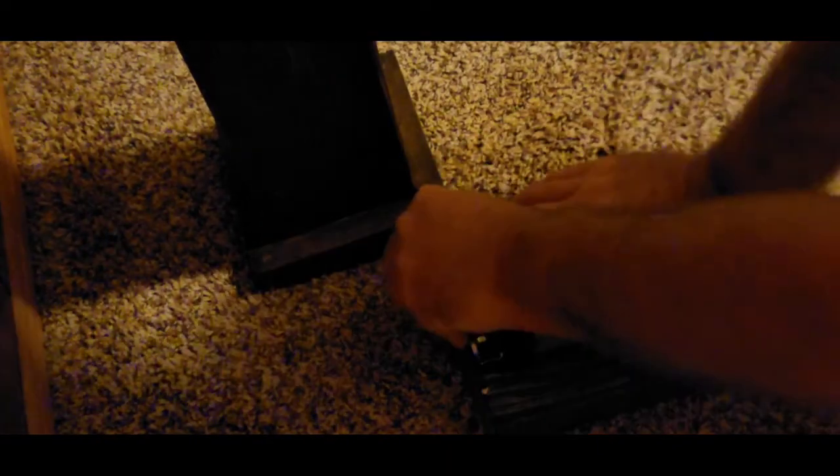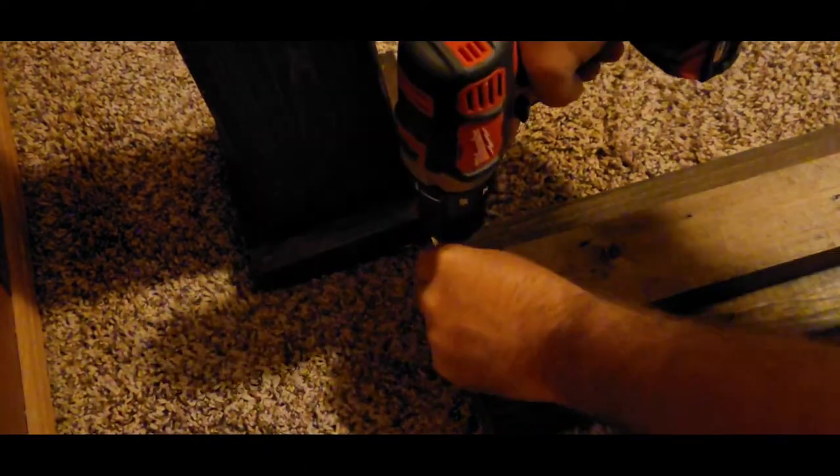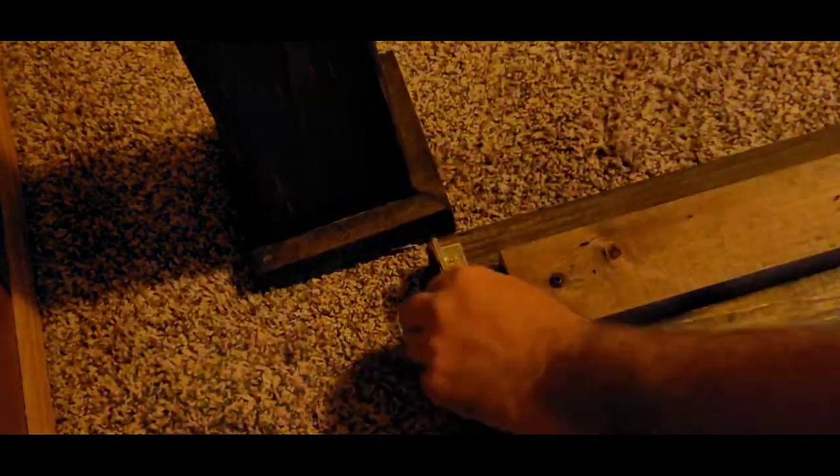Next up is the bed frame hardware. I ordered this bed frame hardware off of Amazon. It was like 18 bucks. I'll leave a link down in the description. It's not real hard to install. Just make sure that when you install it, you use both pieces at the same time to set your distance from the edge. If not, you'll have gaps.